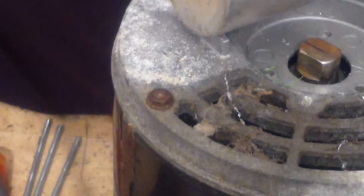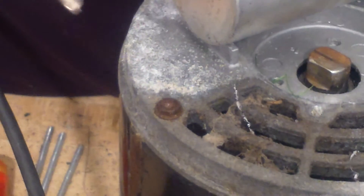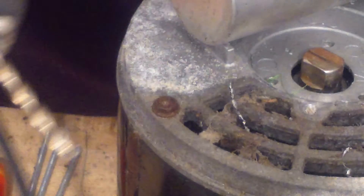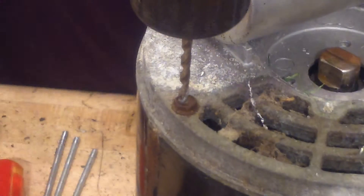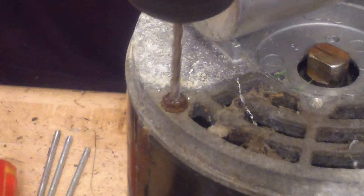And that wasn't supposed to happen, but you can see a center punch there. Now Robert's coming in. I'm going to take my drill — I'm using a cobalt steel drill bit, which will drill through nice and fast. I'm going to place it in my center punch hole just like this, and it goes through.